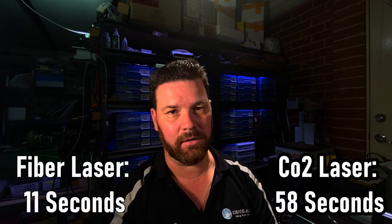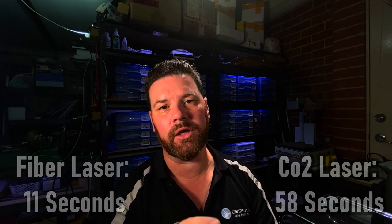In fact, the CO2 one is probably a slightly darker color, but that could be just changing some settings in the fiber laser to help it etch a little bit darker. The fiber laser is a lot quicker — that's the difference. The fiber laser has got a little bit of a burn mark going outside of it, but all you do with that is just wipe it over. It's only because it's etched some of the metal off and it's just sprayed out around it, so you just give that a bit of a wipe off, and then it's super clean, super crisp, and it's really, really awesome. So you can actually engrave these things with either laser — they're not going to make any difference. The only thing is the fiber laser is a lot quicker, that's all.